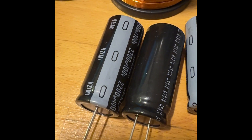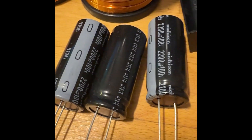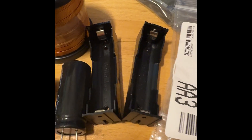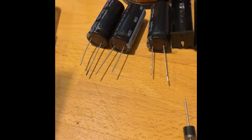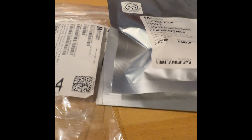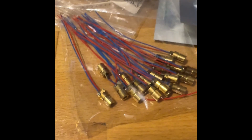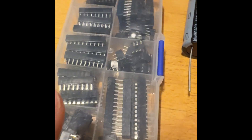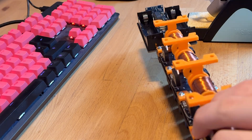Let's take a quick look at the parts I used, then it's time to assemble. I filmed the whole thing in portrait mode, so there are black borders on the edges. I'm using 2200 microfarad capacitors, two 18650 battery holders, a boost-buck converter for 35 volts which I hacked to 45 volts, a few other small components like resistors, a lot of LEDs, a laser diode to show where to shoot, the S4055 SCRs for powering the coils, and of course a holder for the Arduino.